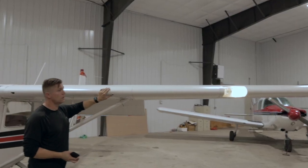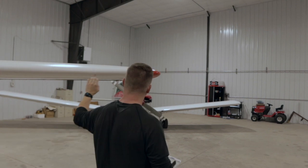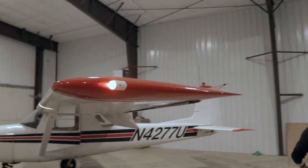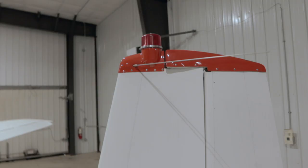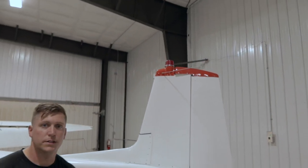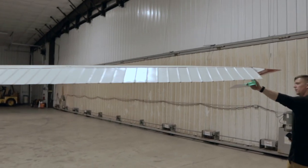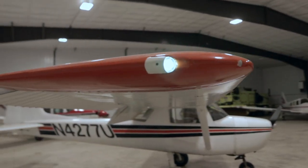Install warning horn — sounds good. That light's good, good over here. Looks like our beacon needs some attention — we'll have to address that before we take off. Not legal to fly without a beacon. This light is good, and we're good here. All the lights are good except we're going to have to address that beacon.